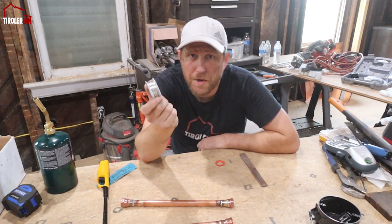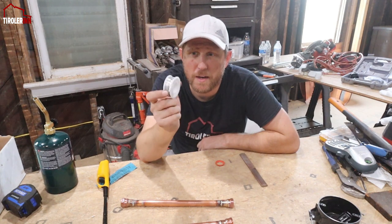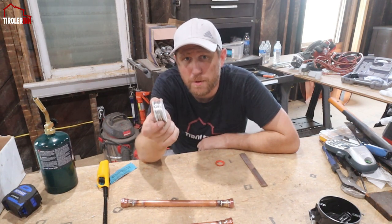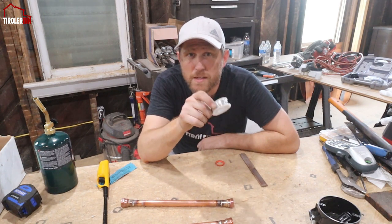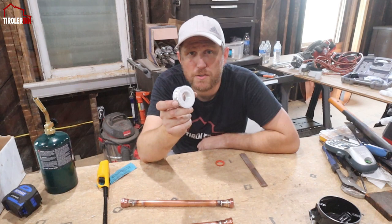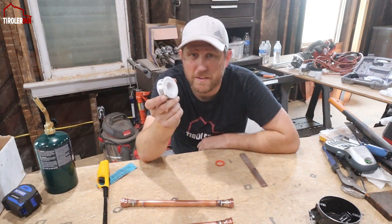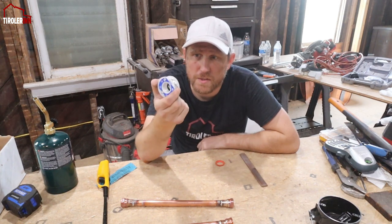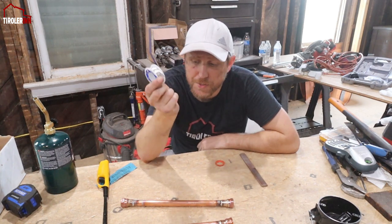If you're doing something for water, obviously I will recommend to buy a lead-free option. It should usually come in your plumbing aisle and it should say it's for plumbing versus for electronics. In the electronics, you might have lead versions because nobody's gonna touch it with their tongue and lick it. So therefore, always make sure in water scenarios, use lead-free options.